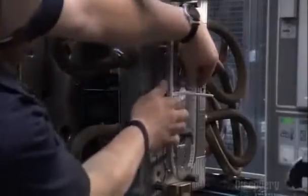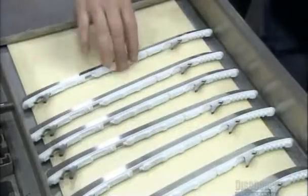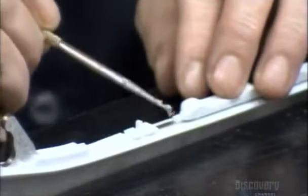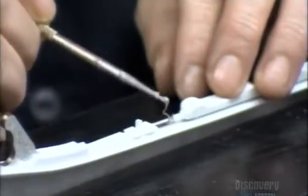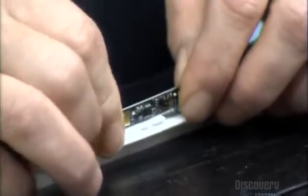Once bonded with the overmold, the blades are ready to receive the electronic smart board. The smart board fits into the plastic overmold that runs along the top edge of the blade. After removing excess plastic from the mold, the technician places the prepared blades onto a mounting tray and uses thermoconductive glue to ensure contact between the heating wire, the temperature-controlling smart board, and the blade overmold.